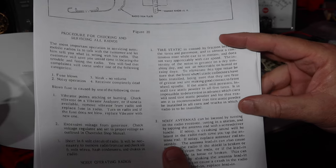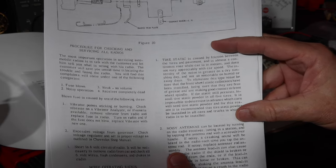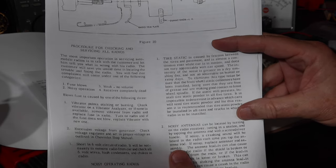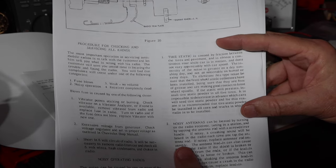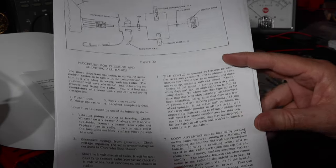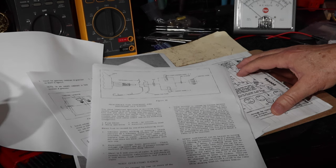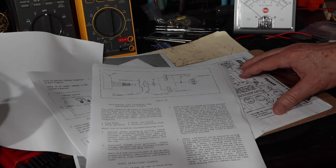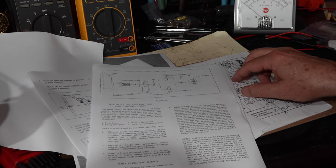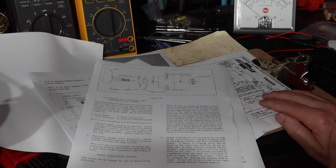I'll just say, and this is me just speculating, okay? When the engineers designed this, they weren't living in a world where they're saying, where would be the best place to put this so that I can service this in 70 years. Their problem was more nuanced than that. They also had to deal with manufacturability, and they were making a transformer designed specifically for use with vibrator type systems for thousands of these radios. So somebody made the decision to take the capacitor that we're going to need for noise suppression of the vibrator and just put it in the transformer, rather than having another item somebody has to wire up and solder. It's all taken care of. So I think that's a very likely possibility for what that is.